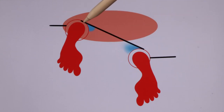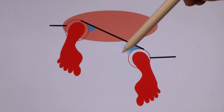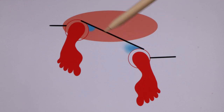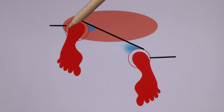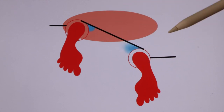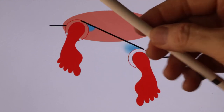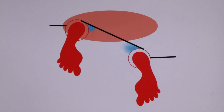These cuts, on the other hand, are not acceptable. They're almost tangent to the surface and making really sharp points of rubber. This cut line needed to be down here, not way up here — these missed. The outer ones are okay, but the inner ones are absolutely no good; those points of rubber would be too weak. So when you go to cut a model, think about the angles you're coming in at as much as you can, and you'll have a much better chance of making a mold that closes up properly and is magnifico.